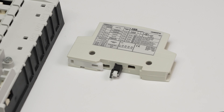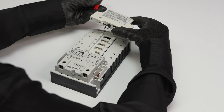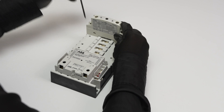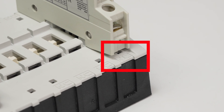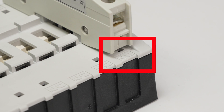For a normally closed installation, ensure that the plunger is on the left side. This side will be aligned to cover the NO engraving in this example. Finally, confirm you have the desired configuration by checking the engraved marking shown. Notice the NC engraving is visible this time and the NO is not, indicating that the pole is set up as normally closed.